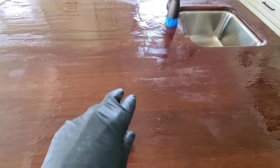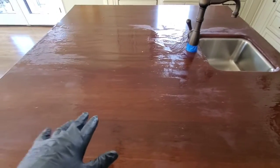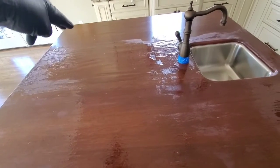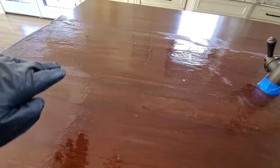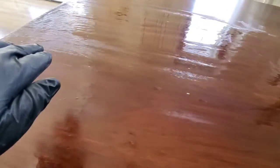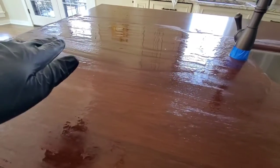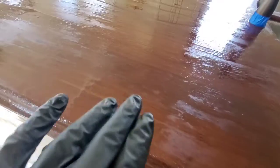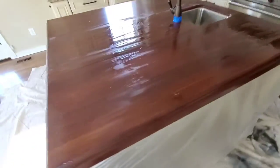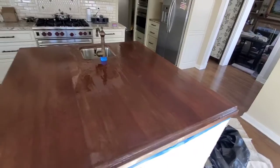After I got that first coat on there there's a little bit of residue. This is probably going to take two coats per section, so I'm going to hit it here twice, there twice, and the end twice. The second third has its first coat on there pretty heavy — you can see a little bit of drying out, but that's okay. You just don't want to let it completely dry. That's pretty heavy over there as opposed to over here, because this is the second time around. I'm going to scrape that and hopefully that's the last time — tomorrow we'll sand it.